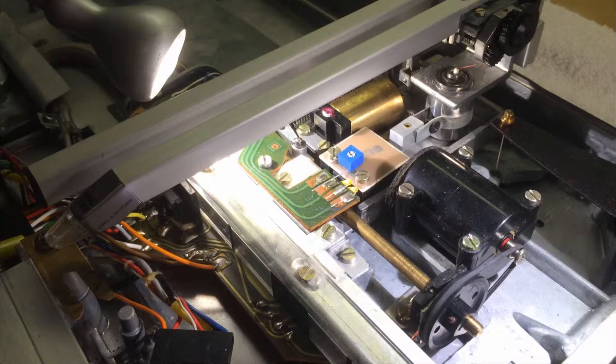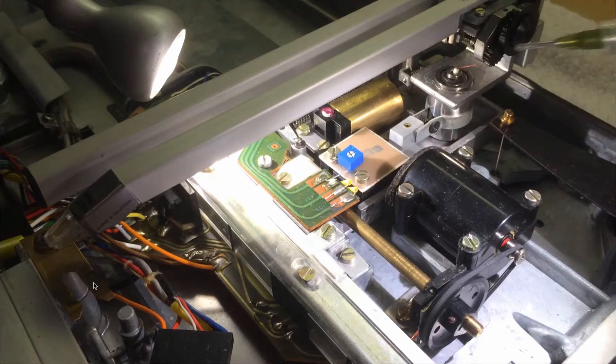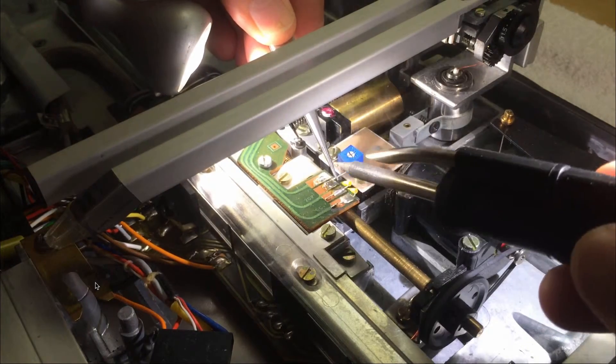You may have noticed that the light bulb had two leads while my assembly here has only one lead coming off. I'm using the screw here as the ground contact, which allowed me to stabilize this small potentiometer in place by simply bolting down one of its leads. This screw goes into the metal chassis of the turntable which is connected to ground, so this replaces the connection to the contact pad. All we have to do now is solder this lead here to the 20-volt pad. Before we solder it on, it's good to trim the lead so that it doesn't exceed the solder spot, because if it bends up it could make a short circuit to the platter. Now we can solder it on — just put some flux there and then with a little bit of solder on the iron and holding the lead down it is quickly reattached.